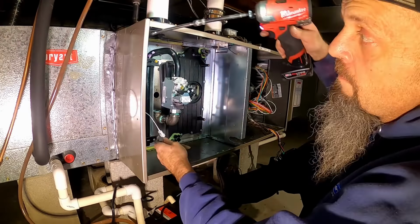I got a feeling there's going to be a lot of problems with these collector box screws. It just doesn't look good. It should be a machine screw with thinner threads on there, like the screws you use for the inducer, but longer. The last design they should have kept. I don't know why they didn't. I gotta give Carrier a call to find out, hey, what the heck's going on.